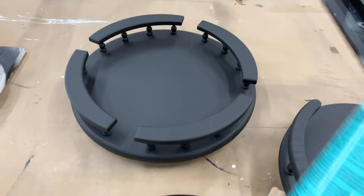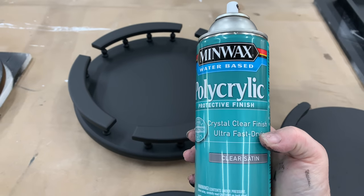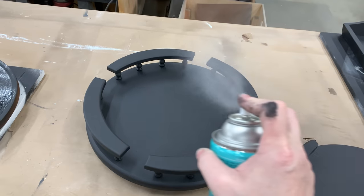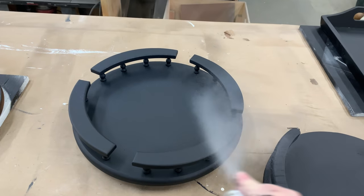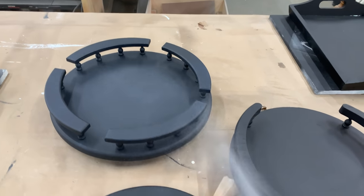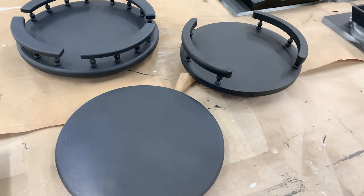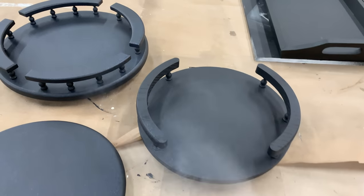After that side is dry, I'm going for the top of it. I want to make sure that it's good and sealed in and food safe. So I'm going for the polycrylic for the top of these pieces — I don't want any problems with any crinkling. Sometimes that Rust-Oleum, even though it usually absorbs into the wood, can do that. So just for my finish tops, I want to make sure I'm using my good polycrylic.